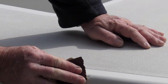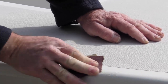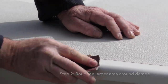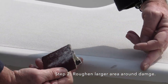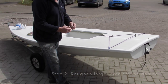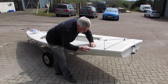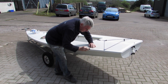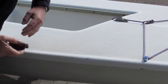We're also going to rub down the area around it quite hard, and this is what people do not like. They end up with an awful lot of scratches into the boat so that they can see the damage, but when we come to actually hide it we're going to take the finish gel right out over to this big wide area onto good and effective gel – and that's the secret of actually hiding it. Keep going with this, really get into that groove, get rid of all the loose fragments, and increase the area that you're working on.